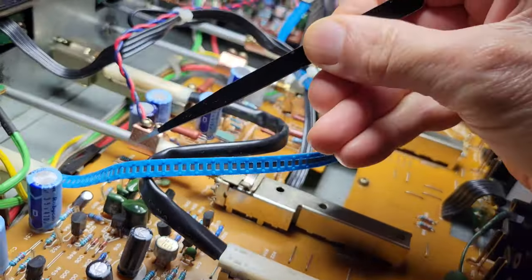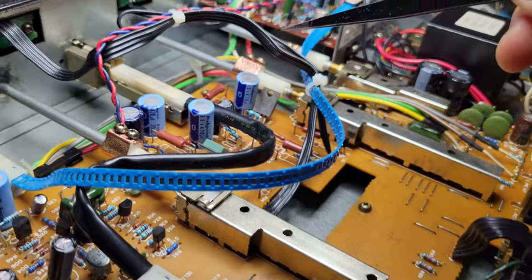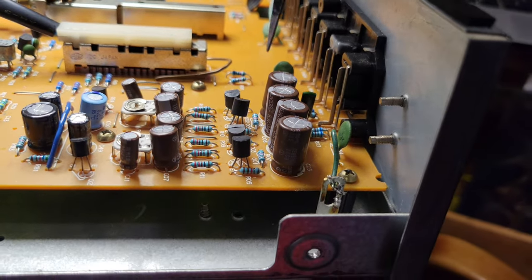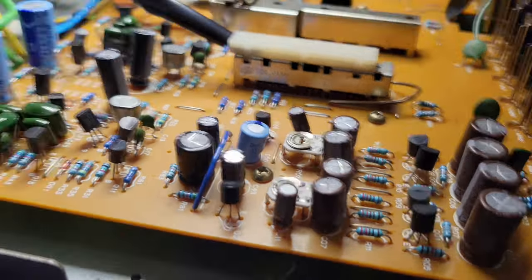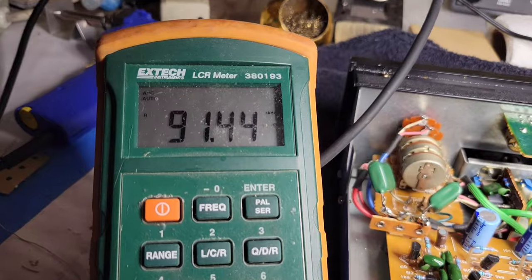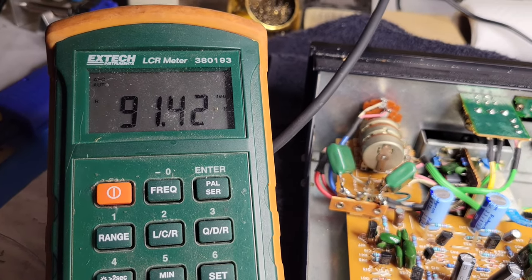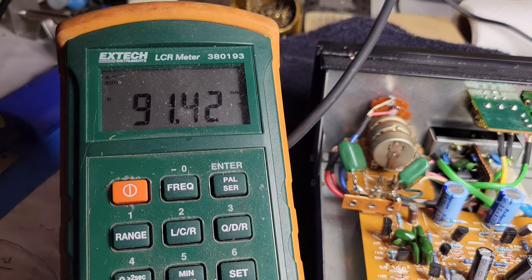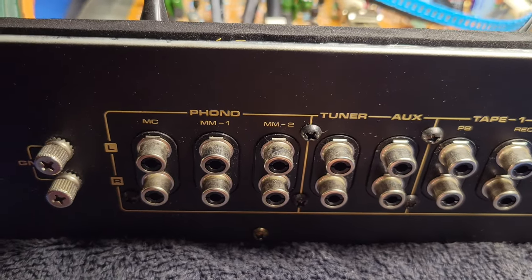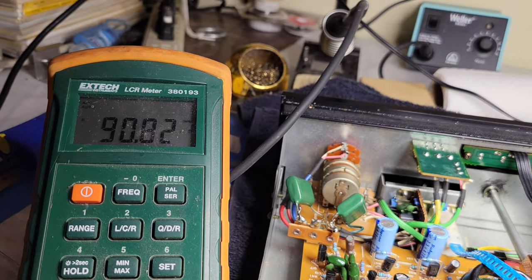You can see that I've been in here before — every one of these plastic things was cracked, so I've fixed those up with copper foil tape. I haven't replaced all the electrolytic capacitors, but I've replaced a bunch of them. You can see all these Elna Silmic 2s here, Rubicons and Nichicons elsewhere, and new resistors. Here's the new impedance — that should be cool, provided I didn't just totally mess up the amplifying circuit. But I don't think so. We'll find out tomorrow when I hook up the new cartridge to the moving coil inputs. If I get sweet, sweet sound, then this is all good. If not, then I've made a big mistake.